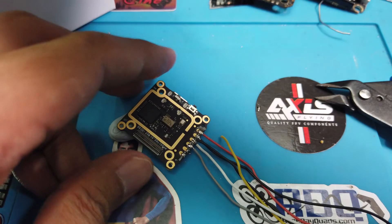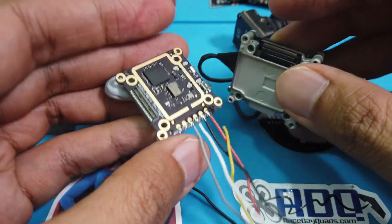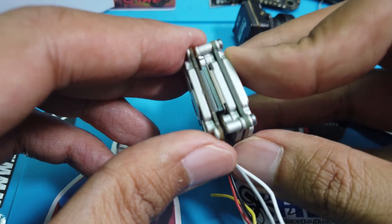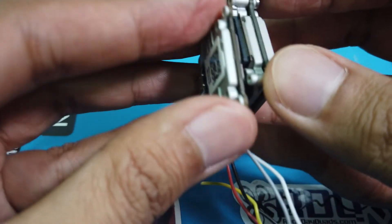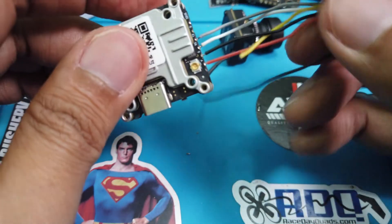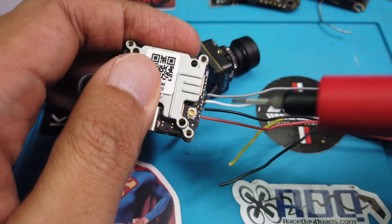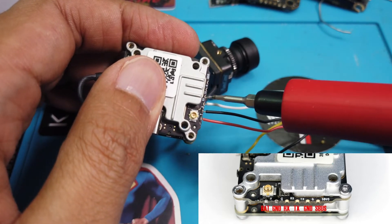Now what we're going to do is put it back together. You have these horizontal wafer-like connectors — put it back together again and get rid of the blue tack. Put it together slowly; don't want to damage anything. Once it fits — snug. So just checking again, looking at the diagram. Before you were looking at it upside down; now you're looking at it from the top: battery, battery, ground, and then this is going to be the RX and the TX.